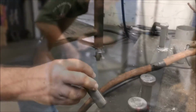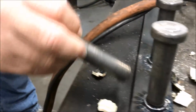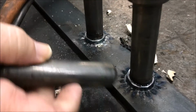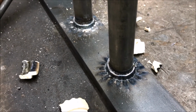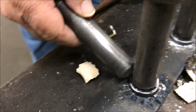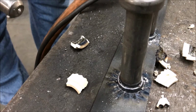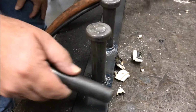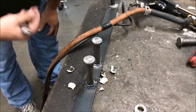There we go. This is how we know we have a good weld. It is chrome, like an iridescent chrome. Nice shiny, and this is important, glossy, iridescent color. And it goes 360 degrees around the whole base of the stud, okay? Now, let's say that this is gray and rough. Well, it's a cold weld, so you need either more heat or more time. Let's say you've got a big giant blob of weld berries all over this thing. Well, you're too hot. Let's bring the time back some first to begin with, okay?